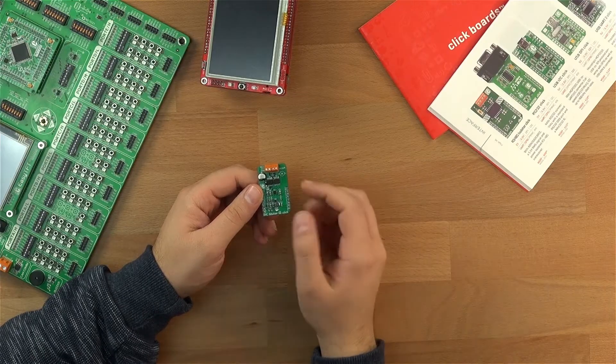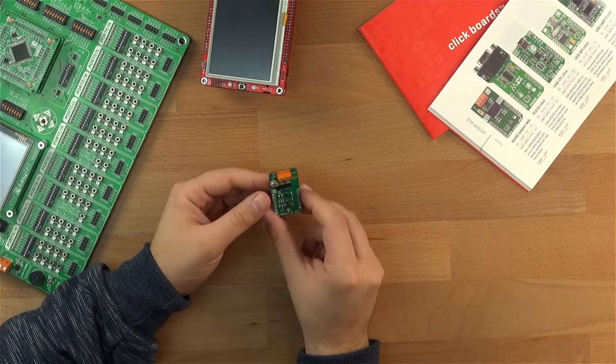This click board uses a PWM pin as an input to regulate the switching state of the output MOSFETs. The fact that it is 85V tolerant allows a substantial margin against kickback voltage, which can appear as a result of motor rotation. The advanced protection mechanism ensures that no shoot-through ever occurs.